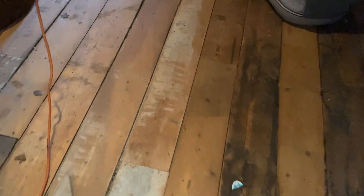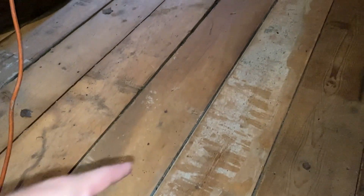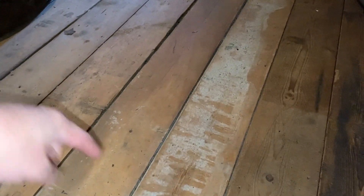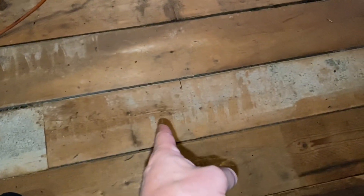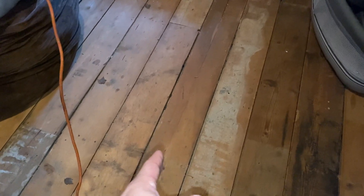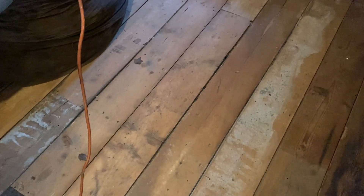If in your attic you have floorboards, you can tell if the floorboards go this way, then your joists are running this way. If you have plywood, you can look at the nails. If the nails are in a straight line this way, you can tell that's where the joist is. If it's the opposite way, then that's where the joist is. So if there's a wall running this way, it could be a load-bearing wall. If it's running this way, it's probably not.